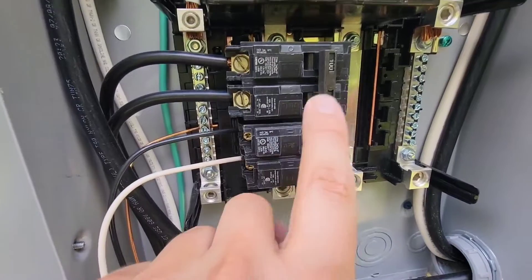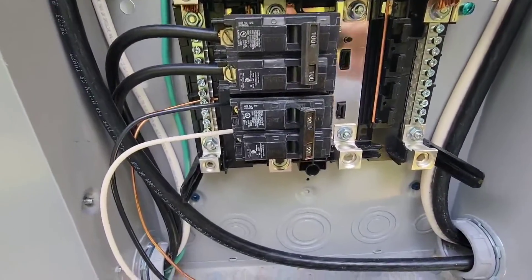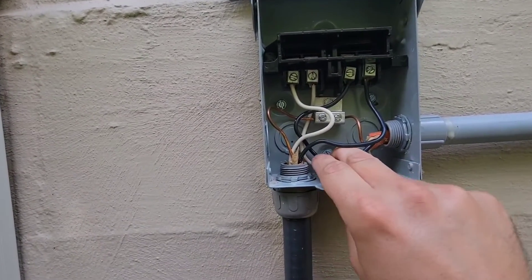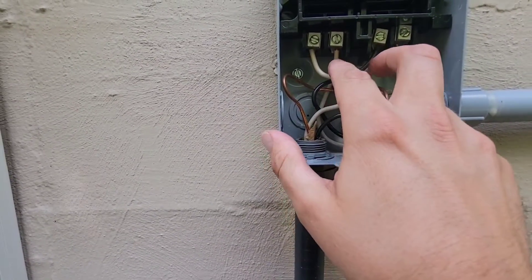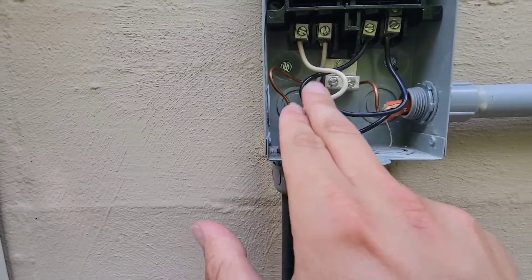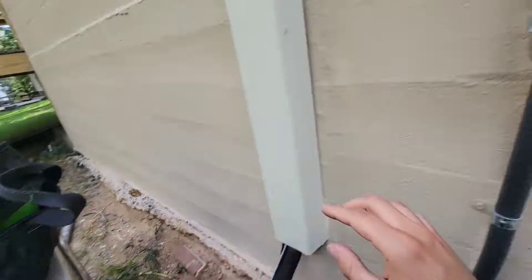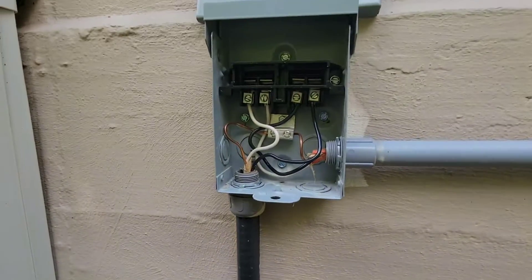This is how we wire up the 230 volt breaker. This is the 100 amp breaker that feeds the main 100 amp box inside the house, and this right here is a 200 amp service. I'm going to show you how this disconnect is wired for 230 volts. We have our load and our line on the outside. So this black and white come in from the electrical box and they go to the line, which should be on the outside. Then these wires that come from this disconnect and go to our outdoor unit, the mini split — they're going to the load, because this is the load. The line comes in and then load goes out. That air conditioner is the load. So we're going to rewire this.